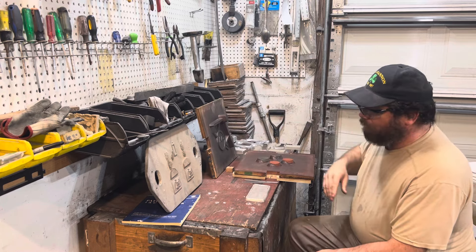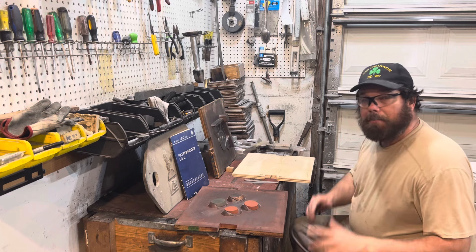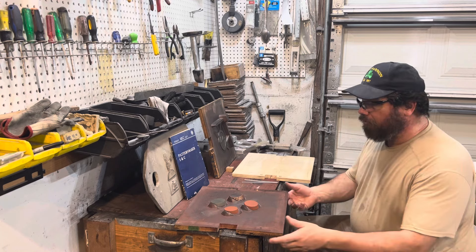Where is there a huge advantage in aluminum matchplates? If you have parts that require a follow board — this is a follow board — by taking an aluminum matchplate you take the follow board out; it becomes integrated into the casting. There are four parts on here that come out. If I cast this into a matchplate, the patterns and everything would be integrated, the gating would actually be on the rear — it's all in the drag, much easier to use. But I still have the problem that I would have to get a helper because I cannot lift this much sand.